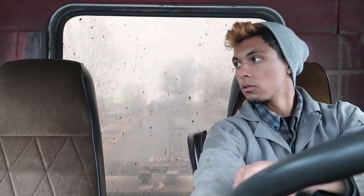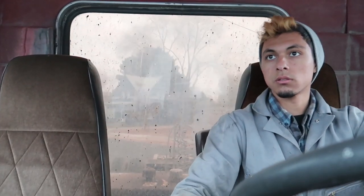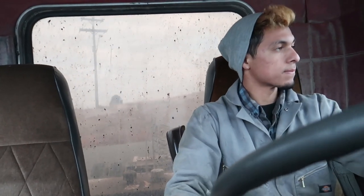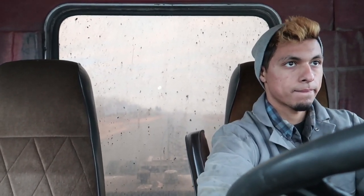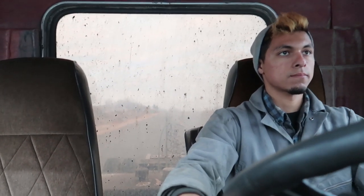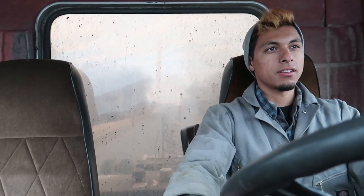I brought my camera but left my phone — priorities. On the test drive, I can't tell if it seems noticeably smoother; it's always kind of rough. The front end does feel a little bit looser than what it used to, and I don't hear the popping. I think we're missing a shock up front, and the one that's there is probably already blown. That's likely why it's so bouncy up front — no damping.